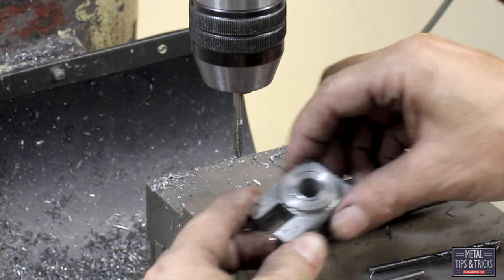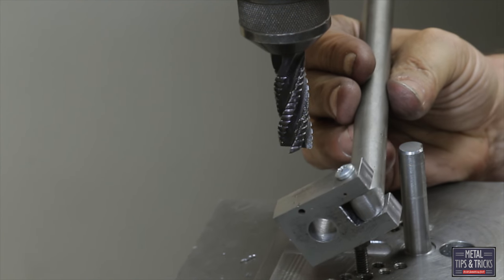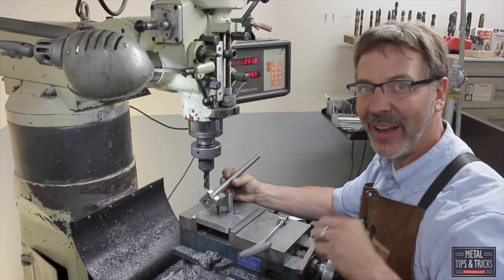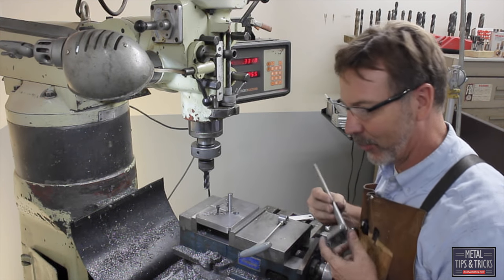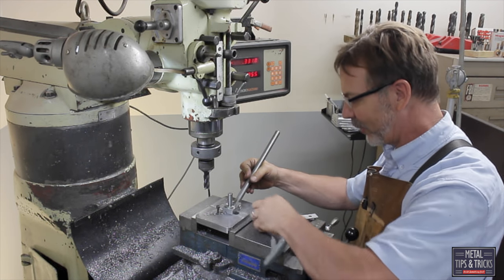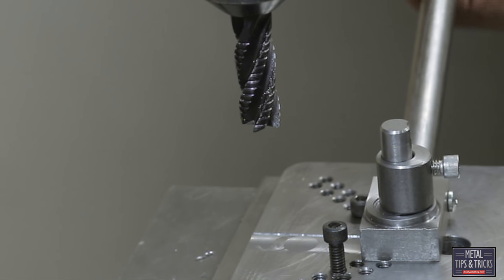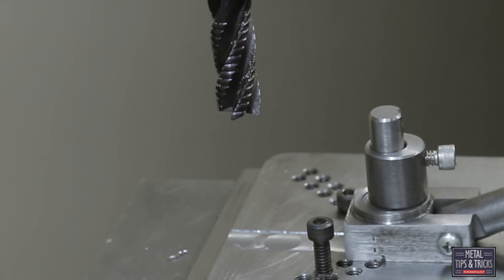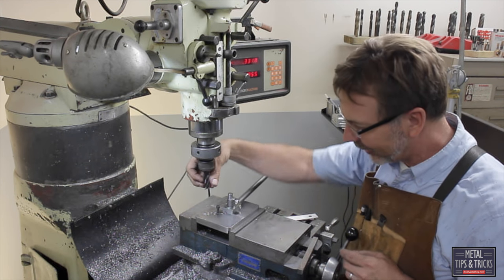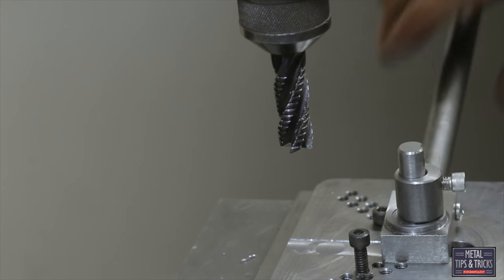Now we need to cut this radius here. To finish this piece off I want to put a radius around it — the square bulky look just isn't working for me. I am going to pull out a special jig for this; it is still in the prototype stage. I have shot the video but haven't edited it yet. It is a little dangerous and a little crazy, but it does work if you are careful. We set this up with a collar and tighten that down, then bring in the cutter and manually rotate the piece to cut it. The collar is needed because the helical flutes on the end mill actually want to pull your piece up, so the collar keeps it stable.